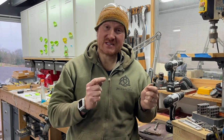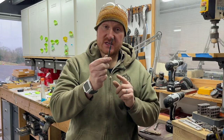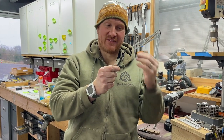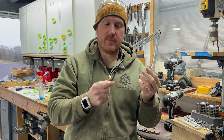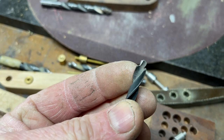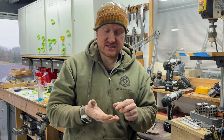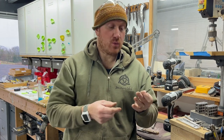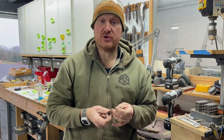I've tested the drill bit on composite materials, stabilized woods, and unstabilized timbers and it's working really well. One thing to note: if it's not a cobalt or fancy drill bit — just high-speed steel — it will dull quite easily on G10, which is glass fiber. But you can use the same technique we showed to keep it sharp and keep those corners nice. The great thing is you can make these step drills or counter bores to fit any handle fastenings you want — you're not beholden to what you can source online. Hope that helps all you up-and-coming knife makers, and remember to tune in next week for another Work In Progress Wednesday.